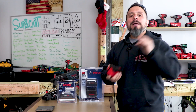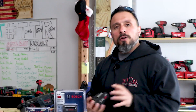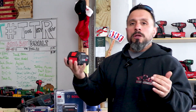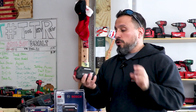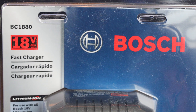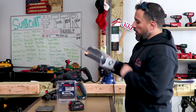Anyone who's been in the trades for a while knows it's the repetitive motions — with battery packs and large heavy tools — that will get you over time. If you can get a lighter, more compact package, you're going to be able to work longer in your trade and career. Another reason to be stoked about the cooling: heat is the enemy of battery cells. It degrades their performance, cuts down their charge and discharge cycles. A cooler design means you're making an investment in a battery platform that could potentially last longer and save you money.